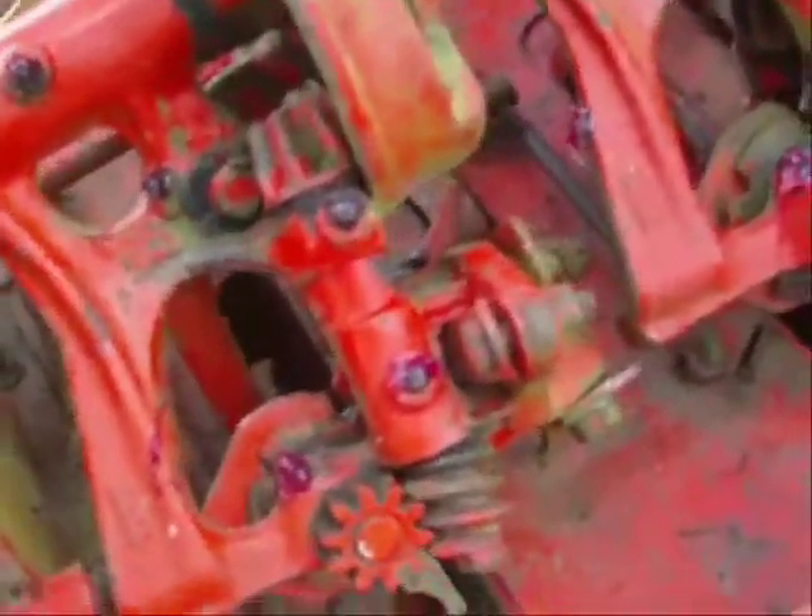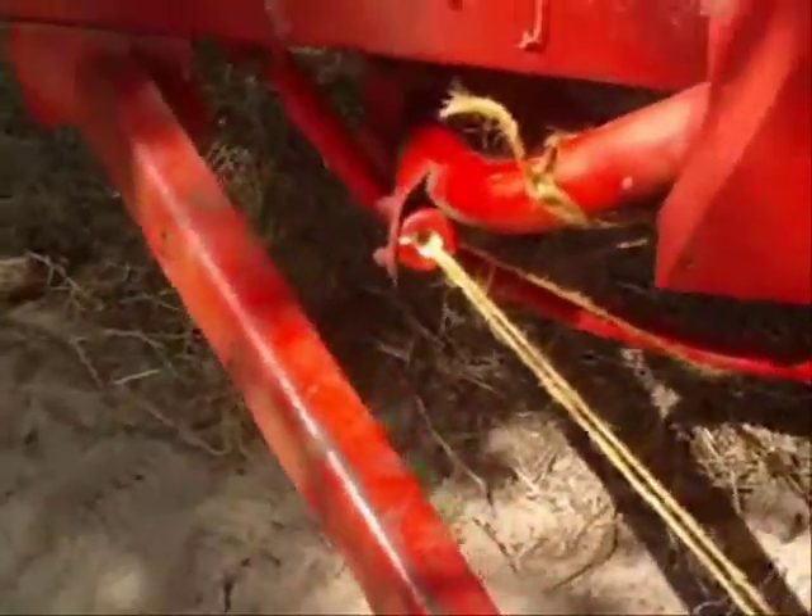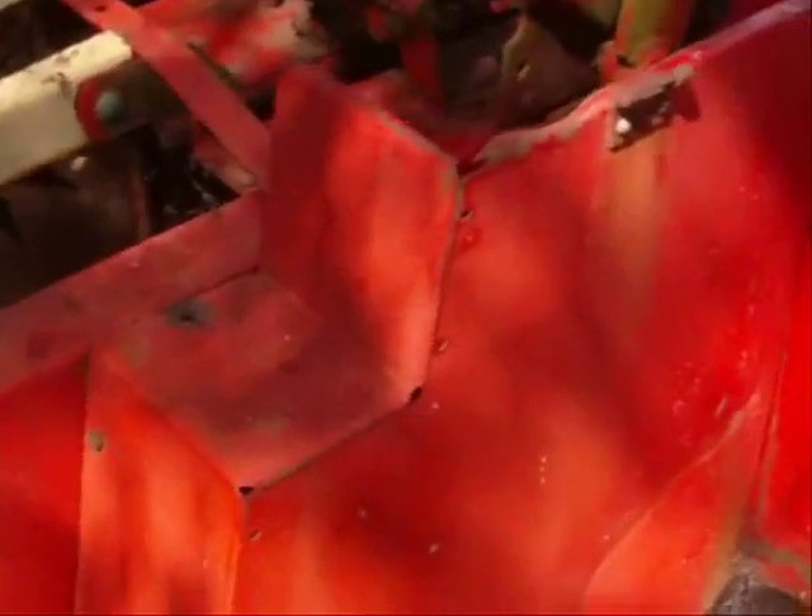I've greased it up — remember, don't put oil on that or you'll never get it to tie. I've got my twine in, just got to go through this tension holder, down through the bottom, and one to each needle, and tie them off. Each needle ties off to something stationary. Just going to start her up and try to grease these chains up good.